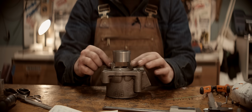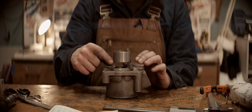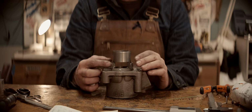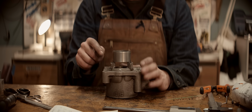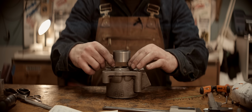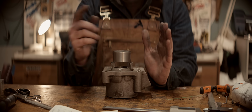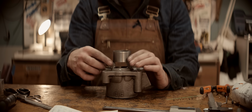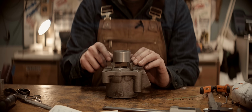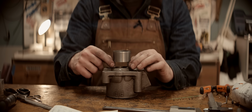A slight little thing here: both the skirts broke off. The press fit was fairly tight, but also I think these were milled to a smaller diameter because they're thin and probably were deflecting while milling, and I've had that happen before. The bore got noticeably tighter when we got down to this section, so that's probably why they broke off.